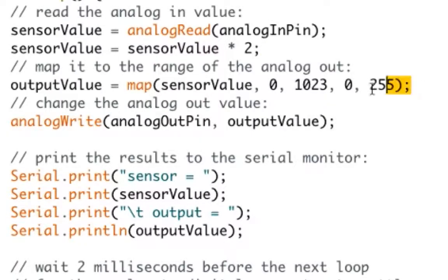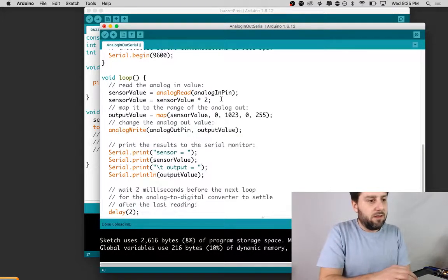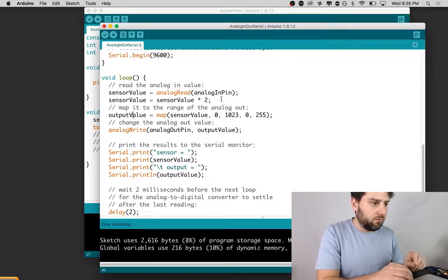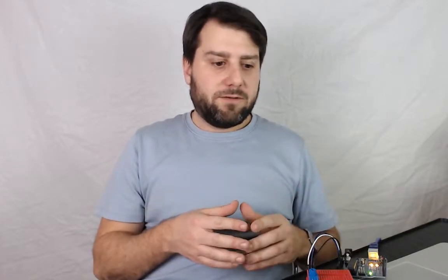And then down below here we see the map function, which is another way of doing that in a more precise way. If you need just a certain number of numbers in your knob sweep, you can do that with the map function. Okay, that's just the basic intro into how to read the values of the potentiometer into the serial port. And in the next video, we're going to bring the buzzer back and have this knob control the pitch of that. Okay, see you in the next video.